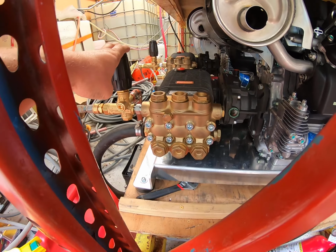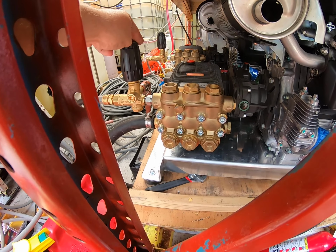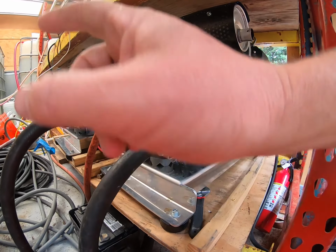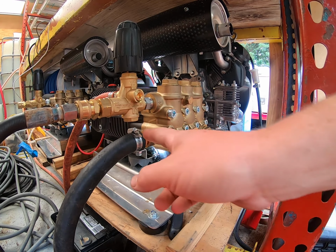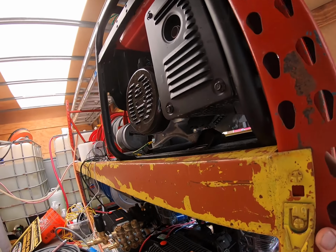This one has a trap pressure unloader, same as that one. That's the only kind of unloader that we're using right now. You can use a flow unloader. That's just another option. We have our 1-inch hose or 1-inch barb that comes into it. We have our hose clamp, so if we did have any trapped air, we could let it out there. We have our bypass that goes over into the top of the tank.